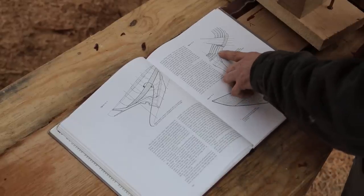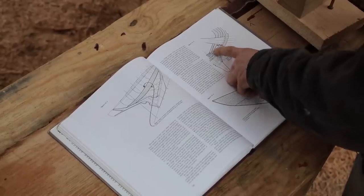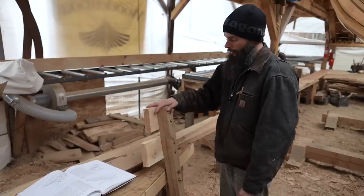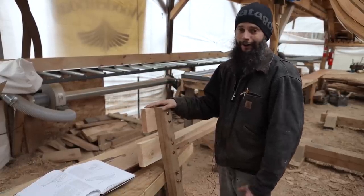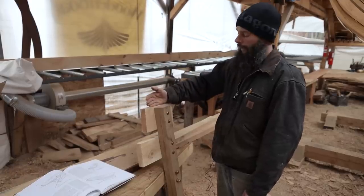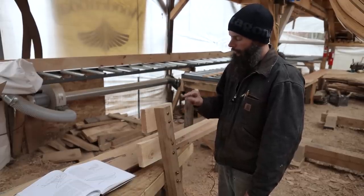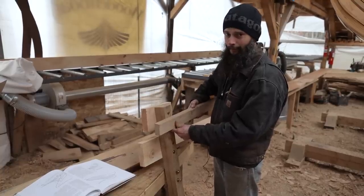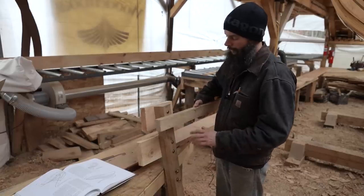Typically what you do is fasten the planking to the frames, and then once the molds come out and all the planking's on, you lay the bilge bands on the inside and attach them to the frames. We're going to do it a little differently, and here's why. We have our test piece from when we initially tried to do some rivets, and we're going to use this to show our logic. Traditionally: you have your frame, you put on your planking, then you go into the interior and lay down your bilge bands or bilge ceiling. One of the issues with using copper rivets is when you go to put your bilge bands in, they're going to ride on top of those copper rivets because they sit proud — and that's obviously a problem.